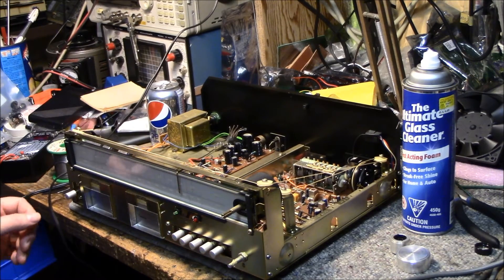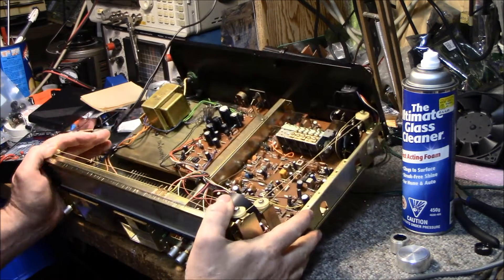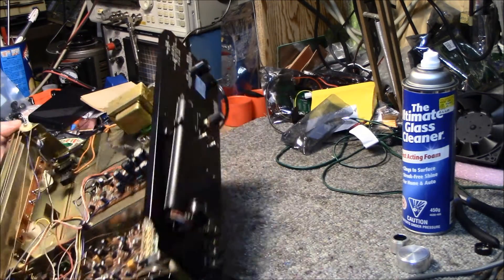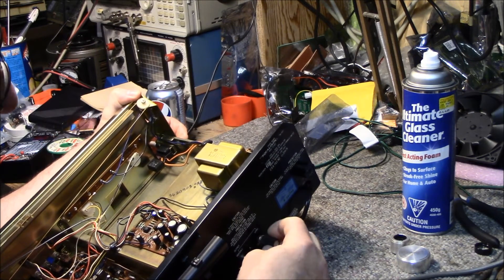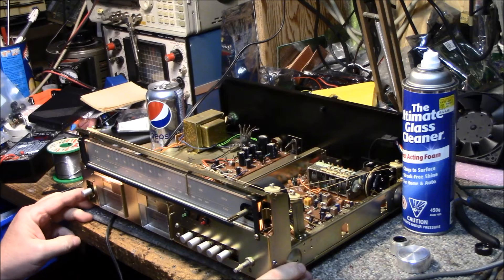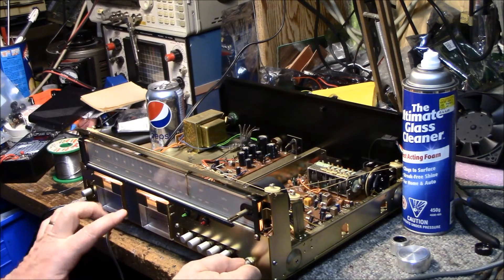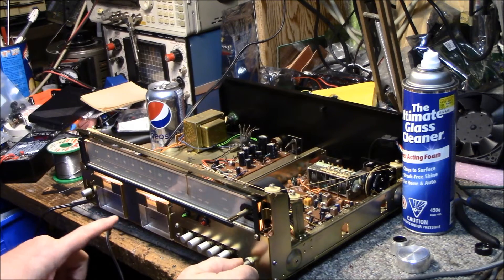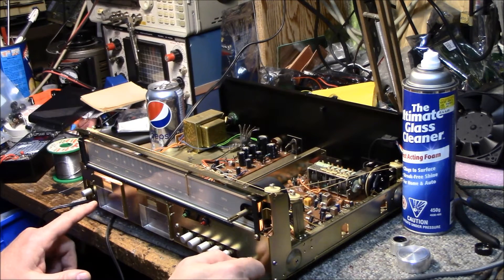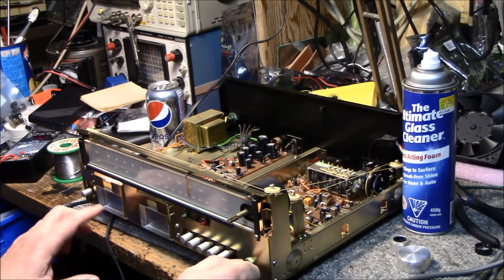While cleaning I had a good laugh seeing the mods I did to this thing when I was younger. There's the heat sink mod — a piece of aluminum tacked on with fins. I think I put the output level knob on the back too. And here's another one: on AM you only have the tuning meter, but on FM both meters come on, so I rewired it so the multipath meter light goes off when you're on AM — less confusing.